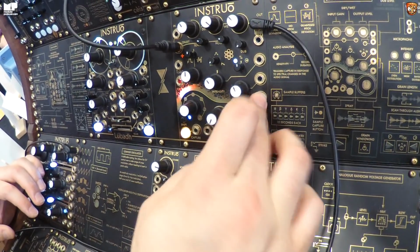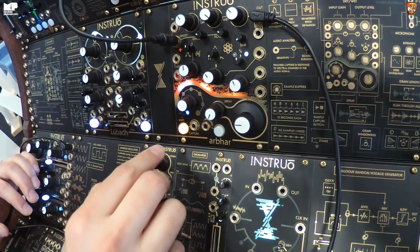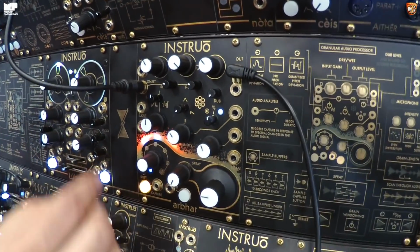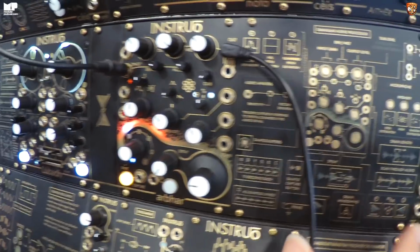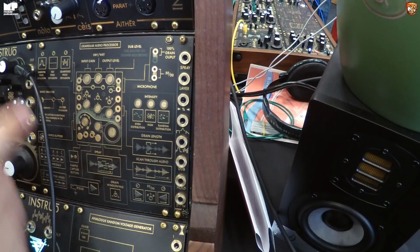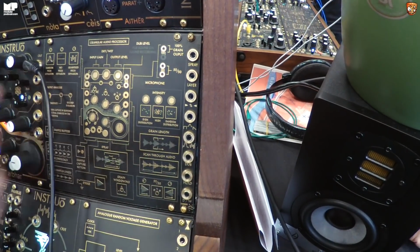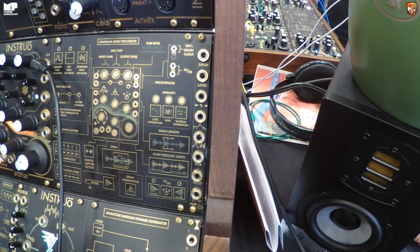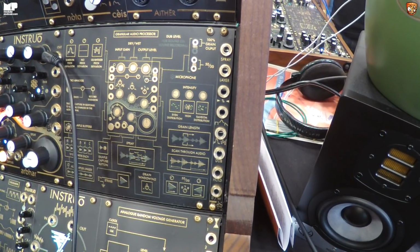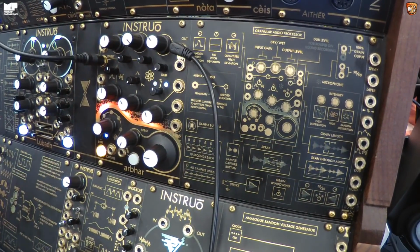On the module itself, we've got CV over scan, CV over length, CV over intensity. There's also a clock output that'll fire when a grain is triggered. But it's going to ship with this 2HP expander, which will give you CV over spray, layer, the probability. It's even got a CV control over the amount of sound-on-sound overdubbing. So just about every parameter other than the analog input level. Yeah, which is super easy to handle anywhere else.